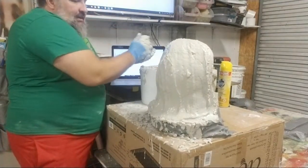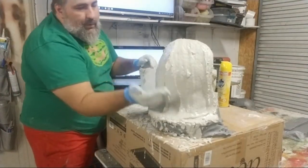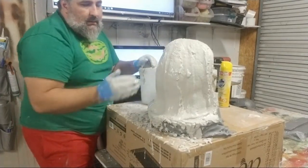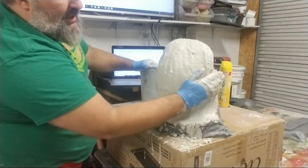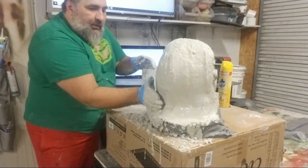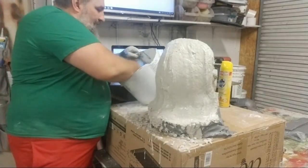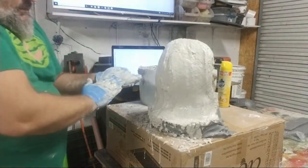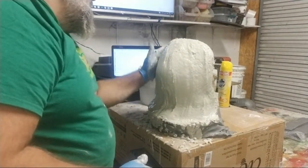Your mold can follow your sculpture exactly, or you could build it up. Make it nice and round. Give it a flat top, so when you pour it, it'll just stand on its head, no problem. Because when you have to support a mold with towels to pour it, or have to pour it inside of a 5-gallon bucket, that all eats time and energy. And sometimes the bucket will shift and throw your mold off. Yeah, you could have problems.